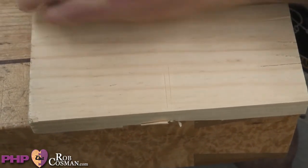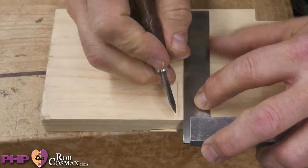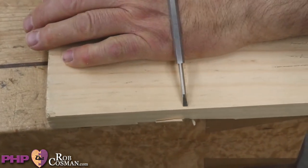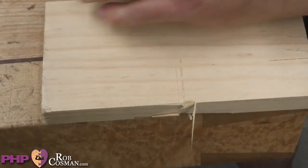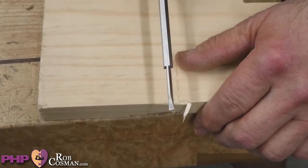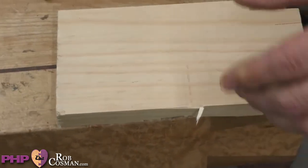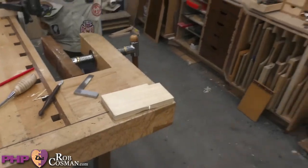I didn't do it wide enough. Okay, bear with me a minute here. I'll just make this a little wider. The teeth on either side sever the fibers, and those little, what's left, this is not working. Well, okay, what's supposed to happen is it goes in there and it gives you a nice clean wall on either side of that trough or that kerf, and the fibers in between just kind of disintegrate. Sorry about my example. It didn't work quite as well as I'd like.